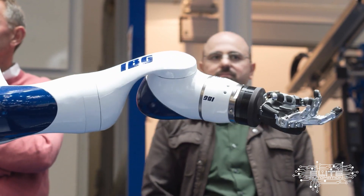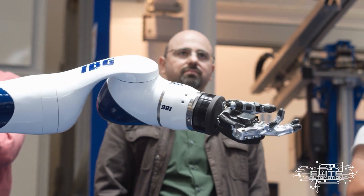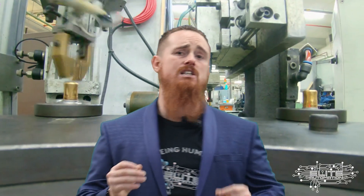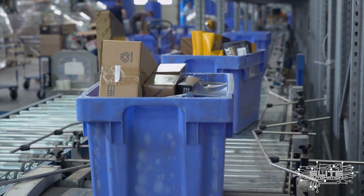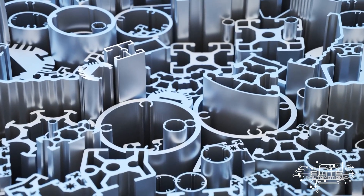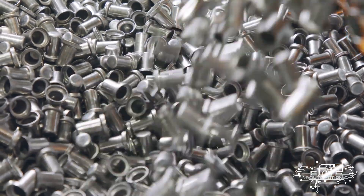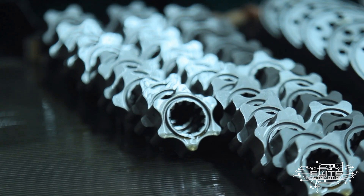Using some rough numbers, you'd have roughly double the usage and life cycle of that actuator compared to industrial applications. The fact that they're going to build these actuators in-house gives them a huge advantage, because one thing you'll definitely struggle with in the market is supply chain. If they're planning on mass producing these, there's always a supply chain issue on some cylinder or actuator — maybe eight of the ten cylinders you need are coming in on time, but one or two of them are holding up the entire process.